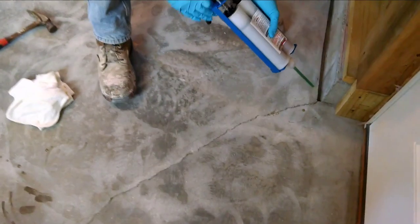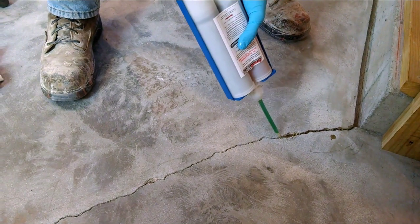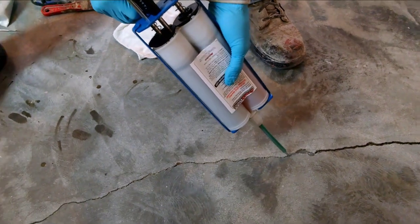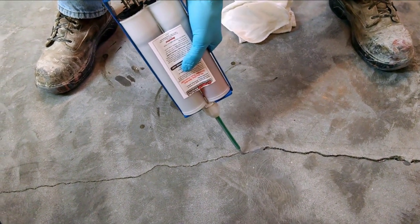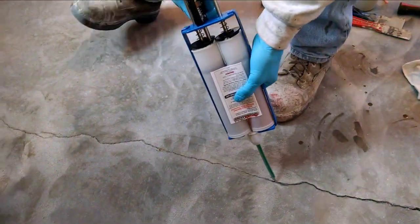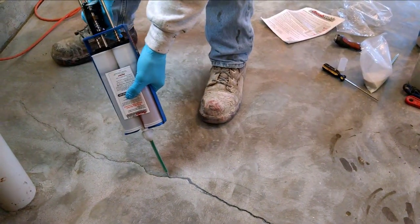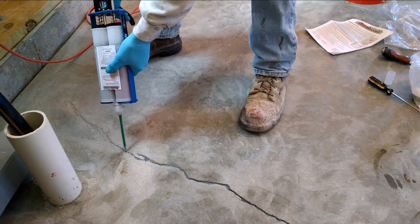The first thing you're going to do, after you get the crack all cleaned out and vacuumed, is prime the crack — we call this priming. We want to wet it out, we want to get both sides of that crack wet so when we put the silica sand in there it really bonds together well. This is about an eighth of an inch wide crack — you could probably fit a quarter down in there. Pretty common shrinkage crack in a concrete floor. That nozzle is mixing parts A and B together as it's going through the nozzle and coming out the end.